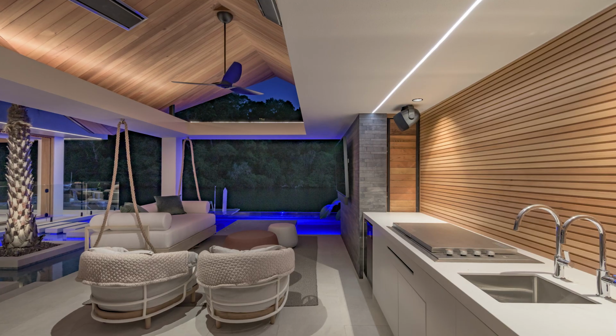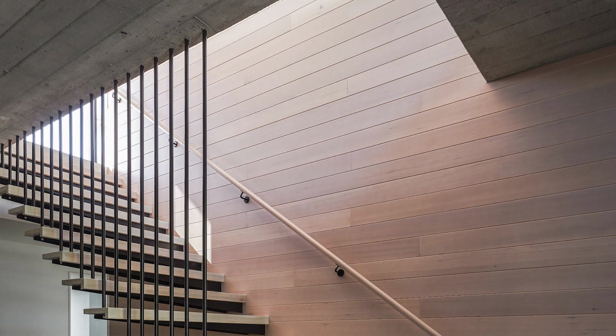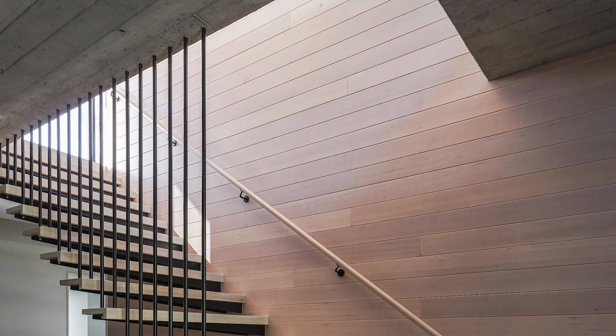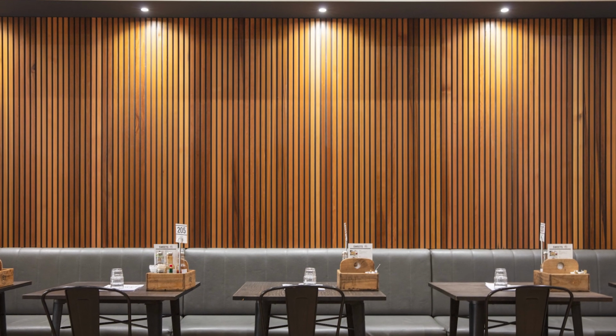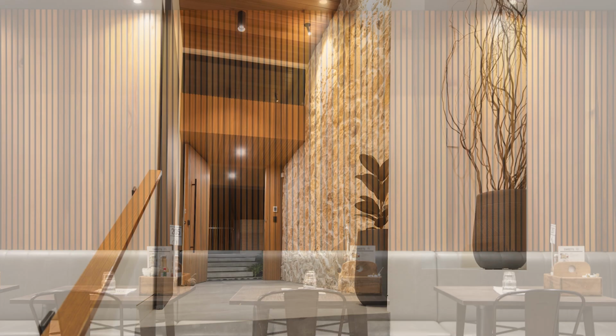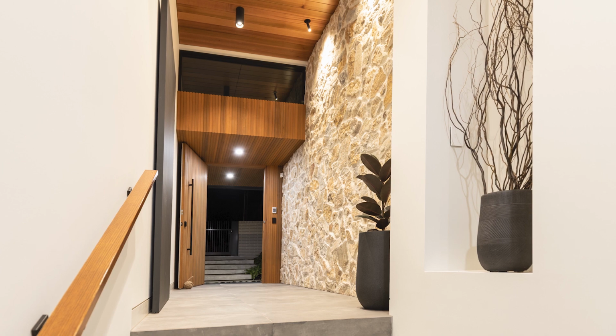For plaster walls, the timber linings can be fixed directly onto the plaster, or you can batten the wall out and fix it to the battens. When applying to concrete blocks, tilt slab or bricks, use at least a 20mm batten to allow for a sufficient air gap. For metal studs, we advise fixing a timber batten over the stud.